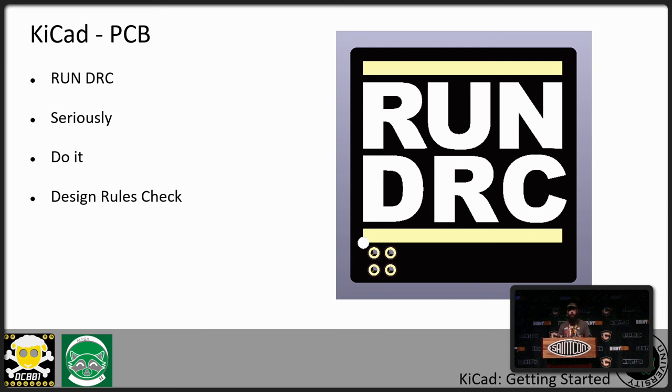Run DRC — the Design Rules Check — on your board. It's just one option you click. It'll go through your board and tell you if things are too close or you've got a footprint overlapping another footprint. You'll get a feel for what DRC errors you can live with versus what you're actually going for. DRC will save your bacon in a lot of ways — it'll tell you if something is shorted or too close. This saves costly mistakes where you send out a board and get it back and realize you didn't hook up the ground plane to anything. Trust me, this is very important.